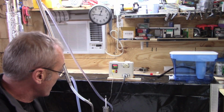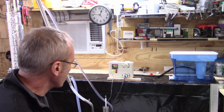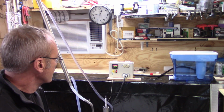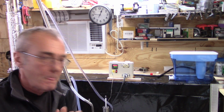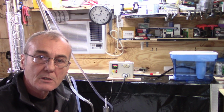Well, we're back here. It's been just a little over an hour now, and I've worked my way up to 184, which I kind of knew is the sweet spot for my still. And I'm hovering within a half a degree or less of 184 on my PID. I'm happy. So it's running. I'm producing right now exactly 160 proof. I'm through the first quart.